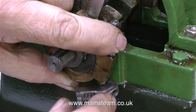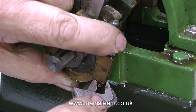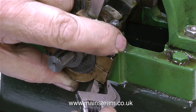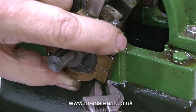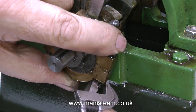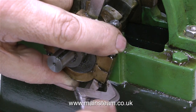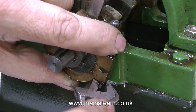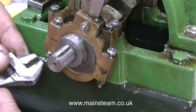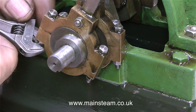The eccentric strap is very, very loose and very rattly. Although it's not a major issue — you can have rattly eccentric straps and they still do their job — if they're as loose as this they will make a clattering noise that you can really do without. There are quite a few more jobs to do on this engine, and I'm going to make the eccentrics a much better fit. But my main brief for this episode is to get the engine running, because it doesn't run very well at all in either direction.